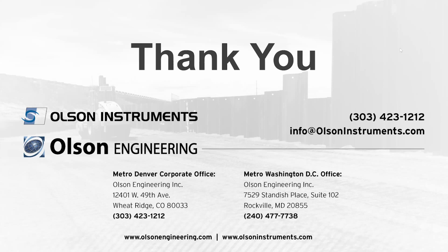Yeah, the University of Maryland and others have looked at various approaches to measuring moisture content in the field. Obviously, people are using the nuclear density gauge, but then you're still using the gauge. But they also looked at the OHAUS moisture meters. They thought that was better. They checked some other things out. Indiana DOT, I talked to them recently. They've looked at the OHAUS moisture meter. They actually are taking the samples back to the lab and doing an oven dry moisture, so it delays it until they can get that oven dry moisture. But one way or another, they will end up with moisture.